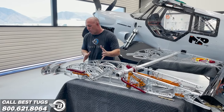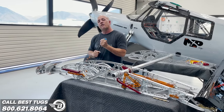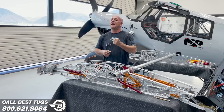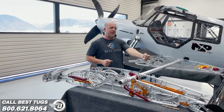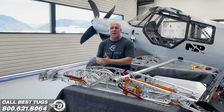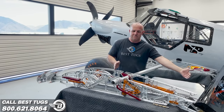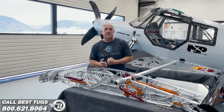So I didn't want to grow the front of the wing so much that I actually added a need for forward pressure. I wanted it to be a little bit aft, but I certainly didn't want to have to pull it way back to my gut and add in power because my center of lift had moved so far when my flaps and ailerons were deployed that I was running out of my rear stick.